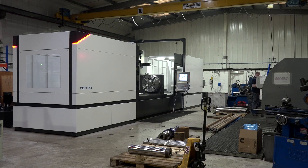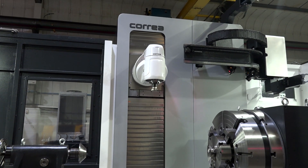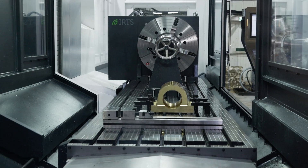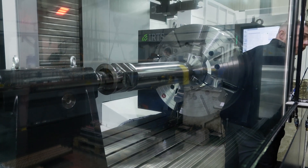Oh my god — night and day, what a machine! It looks a lot more modern, but there are a lot of different features on this machine as well. Let's start with the configuration of the bed — so now this bed is moving and the column is fixed, correct? Yes, this is a travelling bed, a four and a half metre bed, and it's much quicker than the other machine because the bed is moving rather than the column. Does that affect the types of work you would put on this machine? The only limitation is the length — we're cutting it in half compared to the Axia — however we do have a bigger through spindle on this machine, so it allows us to still do over-length parts but we can do them quicker.